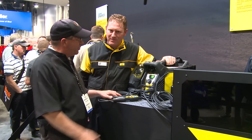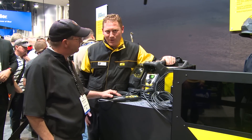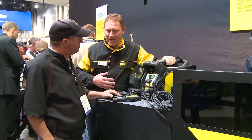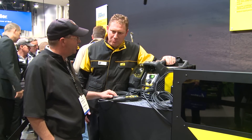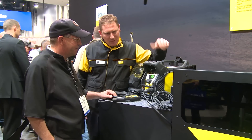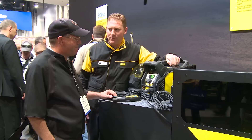What do we require for input power? Our voltage input — we're looking at 208, 230, 460 volt, single or three phase. Auto-link: I can just plug into anything and the machine's going to read that, automatically know that it's 208 or 230. That's very convenient. Either direct wire or put your own plug on it and you're ready to roll.